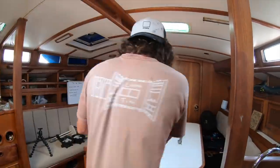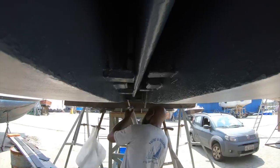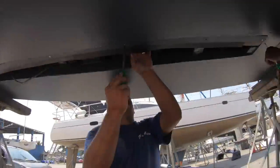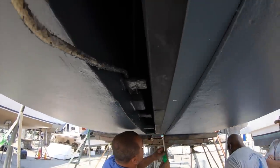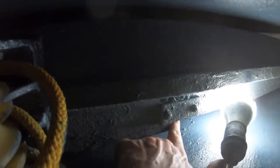I kind of feel stupid — the reason why it wasn't going is because I had this pin in place, it was preventing it. Of course there is always a surprise — we always find new things on this boat. This week we found that we have an extra anode that we had no idea about. We have an anode on the centerboard. These screws hold an anode on the bottom, so now we need to take these off and replace this anode — because this is the only anode on the centerboard itself. We have a lot of anodes on the trunk but not on the centerboard.